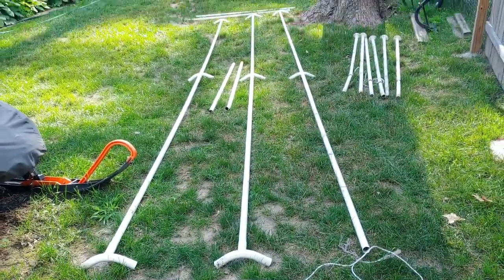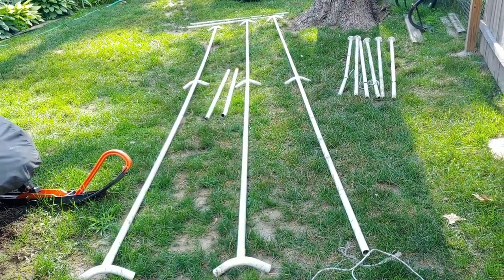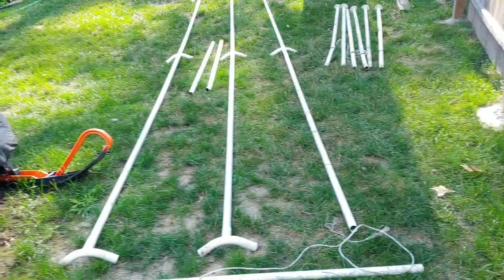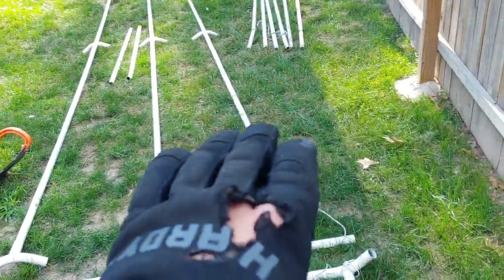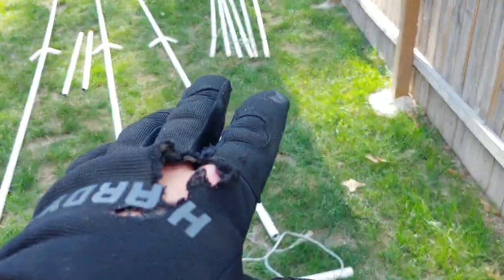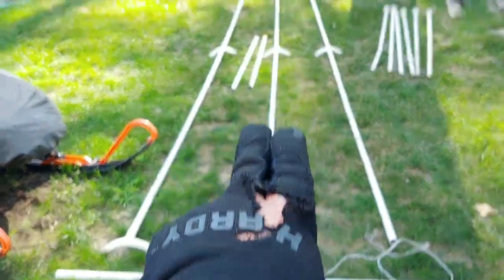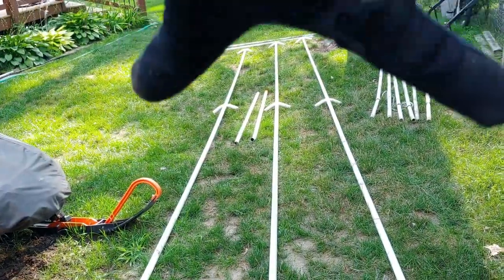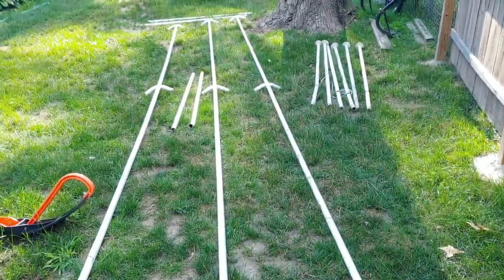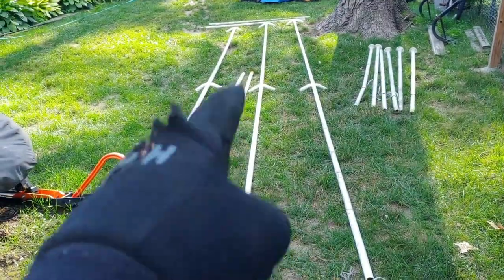And what I'm gonna end up doing, because it's a 10 by 20 carport, this middle section I'm gonna replace the metal on. These two sides here, I'm just gonna leave. I think most of the weight will be on this center portion and the legs. So I'm making all new legs. Those are 6.5-foot legs. I'm gonna go with 7-foot legs. And then there are 3 sets of supports that go out to give me the peak, you know, obviously like that. So those are about 63 inches. I'm gonna replace all 3 sets of those. And then, like I said, the middle portion and then the legs.